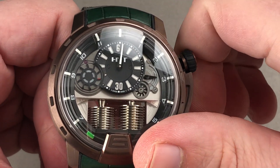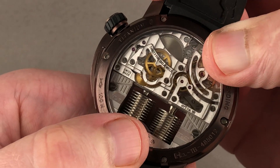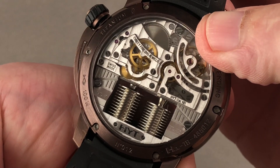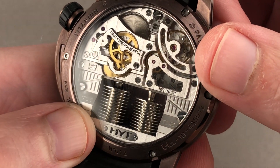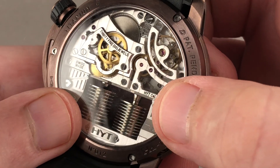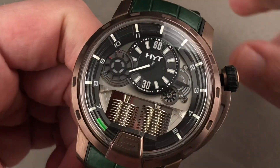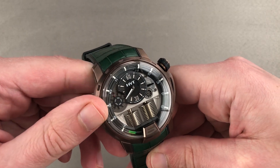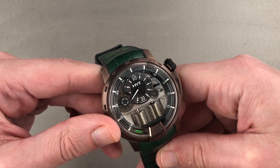The timepiece pushes through cams the two reservoirs, so it has a conventional eight-beat-per-second heartbeat and a Swiss lever, even as the rest of the techno-industrial aesthetic of the movement seems dramatically removed from traditional horology. Don't give up on the traditional horology though — every screw head is black polished, there's a mirrored beveling on the edge of every bridge, large Côte de Genève over all of the bridges, and engine turning or stippling underneath the beating balance. All of this is done in-house by HYT, which is particularly impressive. Some companies build watches with three hands and a date — other companies decide to completely reimagine the way time is told and take over a decade to bring their concept to market. HYT took the hard way.